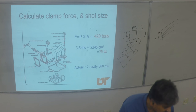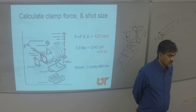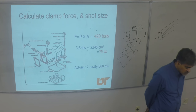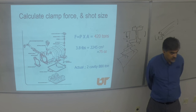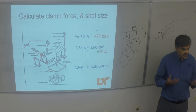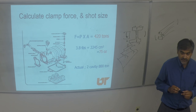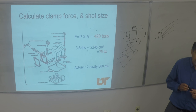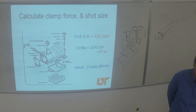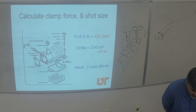Student question: When you inject material into the mold, how do you get out the air that's already inside — wouldn't there be bubbles or back pressure? Answer: The polymer is pushing the air out as it enters, so you have venting holes — called vents — in the mold, on the order of 10,000th of an inch. You can play with that depending on injection speed and how the part fills. It's a window you have to figure out based on your part geometry, not just one setting.